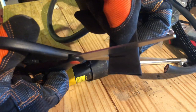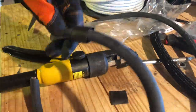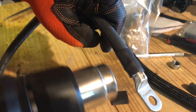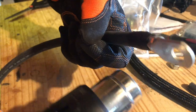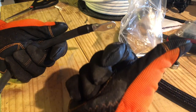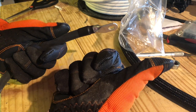Now we need to insulate the ends that we just crimped with some heat shrink wrap. We're going to slide it over the uncrimped end of the cable before we put the extra crimp on. It usually makes a little more sense to put this on before you crimp either end, but you slide it over, grab your heat gun, and go ahead and shrink that right onto the insulation and the metal, creating a perfectly insulated connection. And that's pretty much all there is to it — now we have a solid mechanical connection that is insulated on our heavy gauge wire, suitable for all heavy-duty applications.